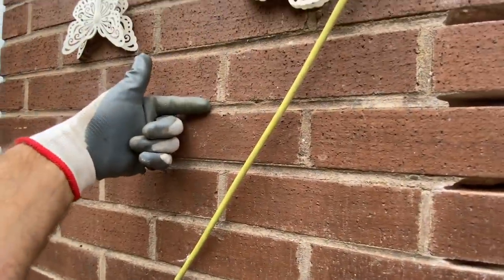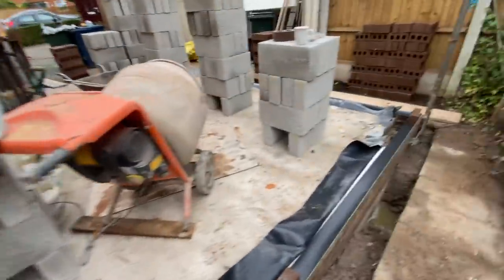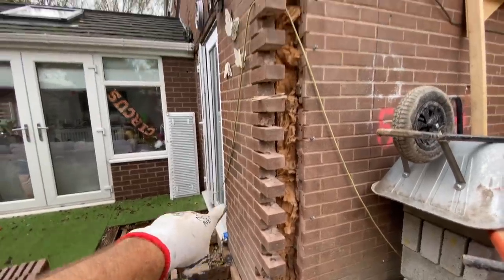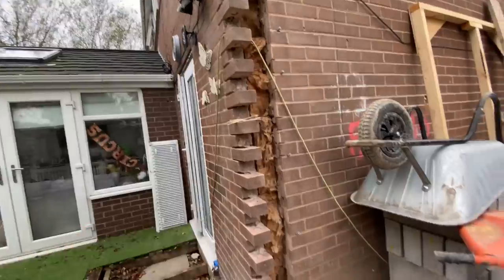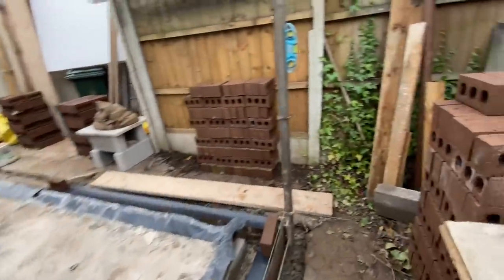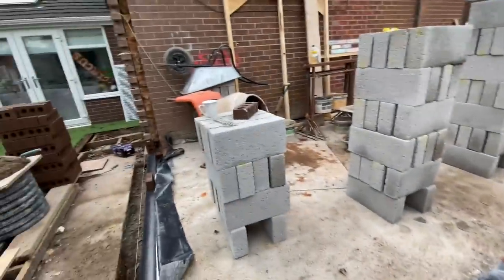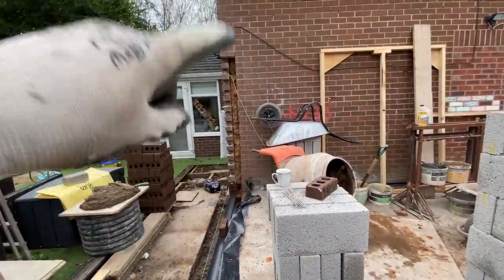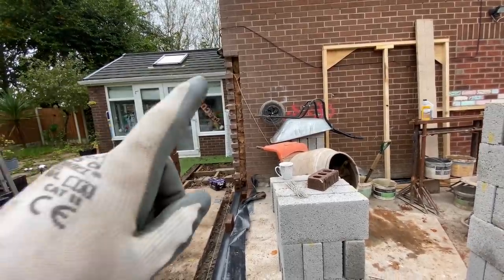They're big beds, them. I'm thinking they're small bricks. So before I started, I've just counted. And for some bizarre reason, there's 27 courses. Now, standard 2.1 lintel height at 75 mil beds is 28 courses. That's your standard thing. So I've just checked now and it's 27 courses.